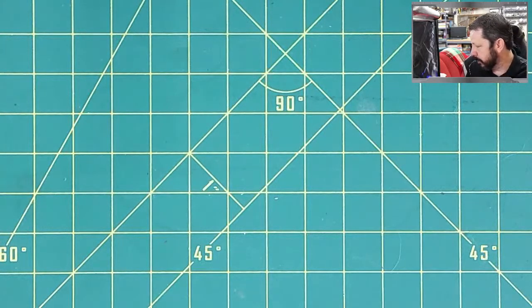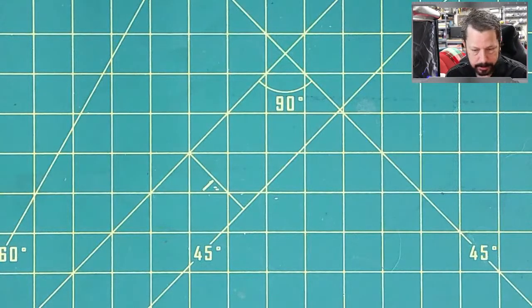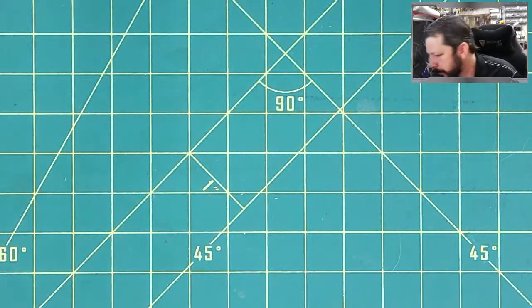So this particular nozzle, being coated, is supposed to help always form that nice retraction shape without the blob on the end of the filament. And it's a high temperature nozzle, so it could be good for any printer also. So we'll see which one I'll end up putting it in. I may put it in one and then the other one after that.